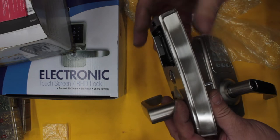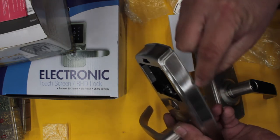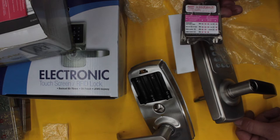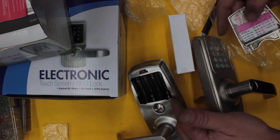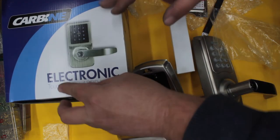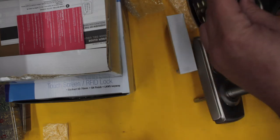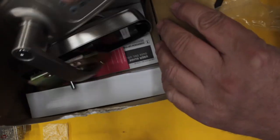The outer shell tended to peel up and didn't sit very well on the back of the door — there are only two screws holding it, so there was always a 1–2mm gap at the top. Programming was fairly straightforward with no big issues, and you get a cheat sheet so once you've done it once or twice you're right. To default the product, you hold down the hash button, remove a battery, and that resets it. The lock says to use only alkaline batteries, but the supplier says to use ProCell batteries specifically — a bit of a discrepancy. There's also a handing button on the inside. Anyway, that's enough about the old one — we're done with them, so let's look at the new one.